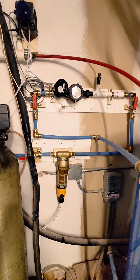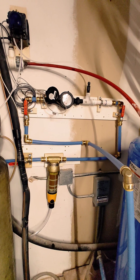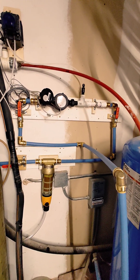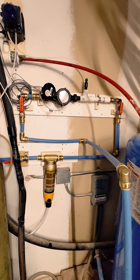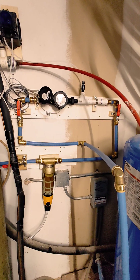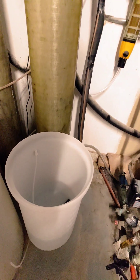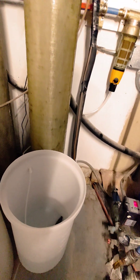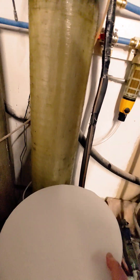So you've got to oxidize the iron 2 to iron 3, and the manganese 2 to manganese 4, so it comes out of solution and can be filtered out. I do this with a hydrogen peroxide injection system. The hydrogen peroxide sits in a tub at 3% — I bought 12% and cut it with three gallons of water to make 3%, which is about 30,000 parts per million hydrogen peroxide.